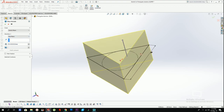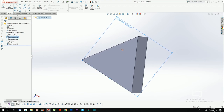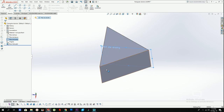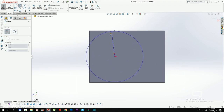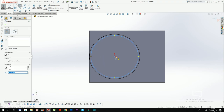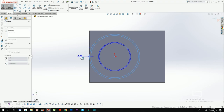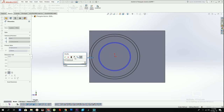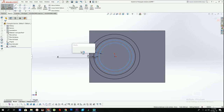Right now I'm doing a triangle that's 80mm in length, because it's basically like a 3x3x2, so you want a 3 to 2 ratio on the faces. I'm going to create a cutting plane perpendicular to this side — I want it drawn on that side of the puzzle. I'll create circles starting at the center, with a tangency to the outermost edge, then keep a margin. I'm going to use concentric circles to get an idea of how far I can go with the cuts — about a 4mm margin so I can put the screw head, 2mm for the mechanism, and another 2mm here.